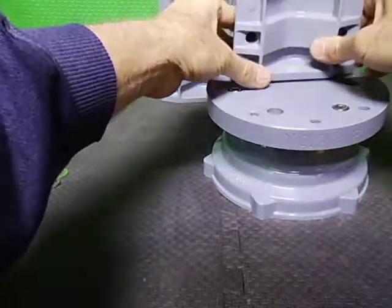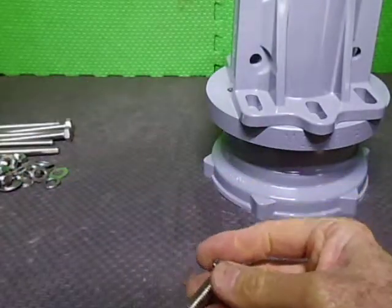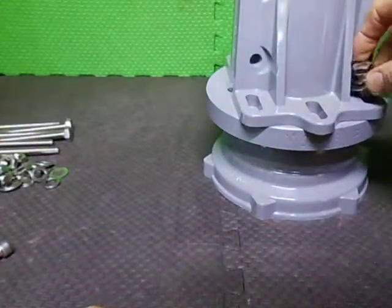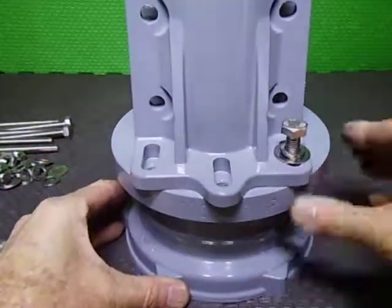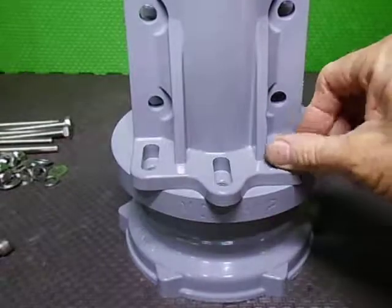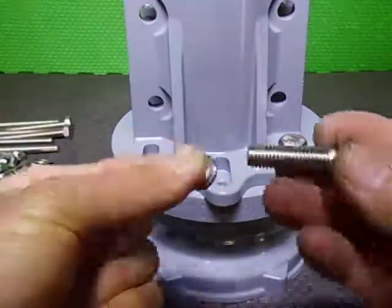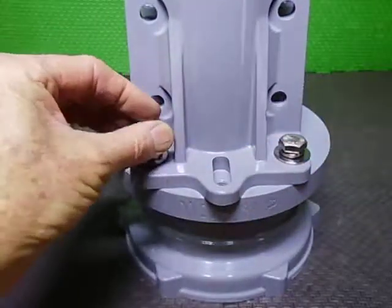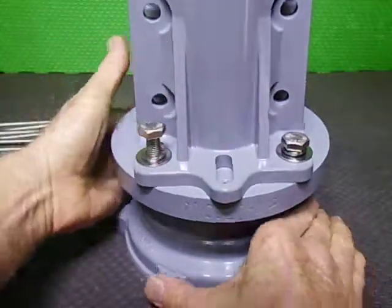So when you stick these mast clamps on this adapter plate, of course we've got all new stainless steel 10mm bolts, not 8mm, 10mm. They'll physically hold down with big washers. So you see there, nice big 10mm bolts, which go all the way through the actual plate. So there's 3 on each side. Spring washers as well, all 10mm stainless steel 316. I'll just put 2 in for now on this side, and then we rotate them around a bit.